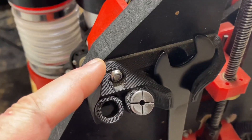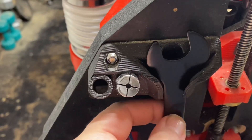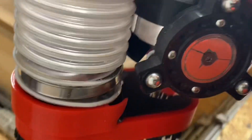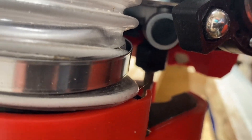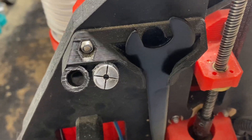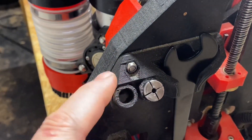I have this 3D printed part — it's available on Printables — and I used it to hold my two Makita wrenches. The Cobalt router only comes with one wrench; the Cobalt's method is holding in the button and applying the one wrench. I'm going to check and see if I can do a two-wrench approach with the Cobalt, because I prefer that to holding in the button.